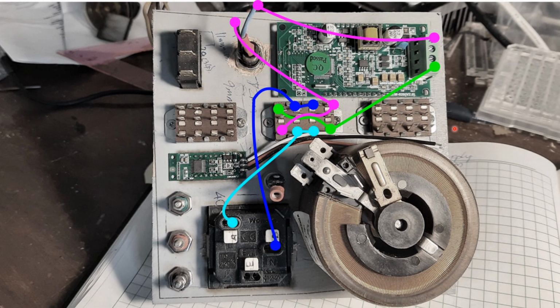So just one more. This is the output side. Essentially, this is earth, the neutral, and live. In the US, it's switched around. So this is the switch, which switches live from left to right or right to left, depending on whether you're looking at the front or not. The AC input is here for the AC meter, and the output is on the external terminals. The output goes through a fuse, then that goes to the switch, which switches the position of live, and then that is fed to the output here. So this was simpler. Like I said, the other one was a bit more complicated in there.